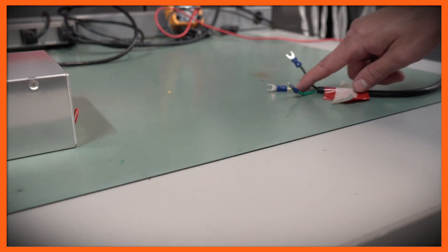The next thing we're going to do is verify the wiring and ensure that we're actually getting 220 volts on our wires. In this demonstration, we're going to show a line cord that has a black, a white, and a green wire. In a traditional 110-volt system, the black would be hot and the neutral would not be hot, and the ground would be ground. In this configuration, both the white wire and the black wire will actually be hot — so both wires will actually be 220 volts from each other. This is how we're going to verify that we have a 220-volt AC system.